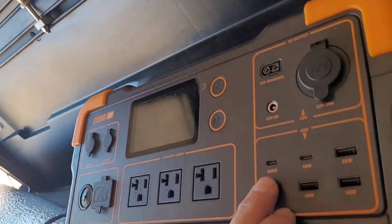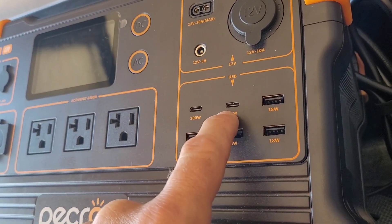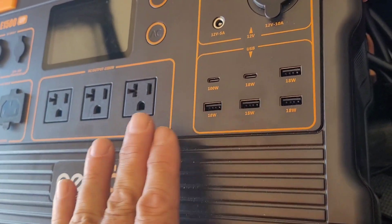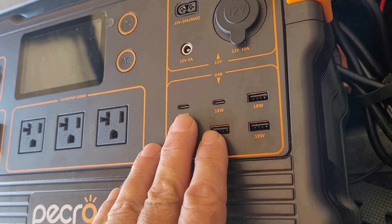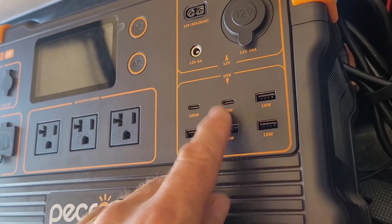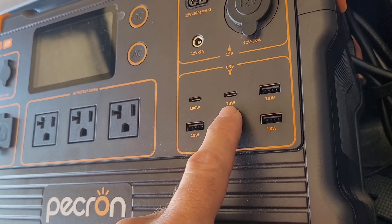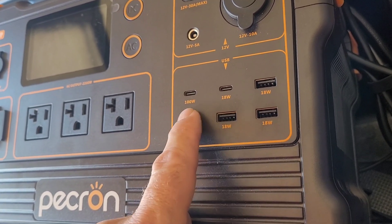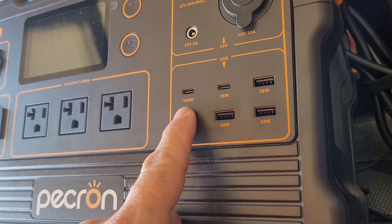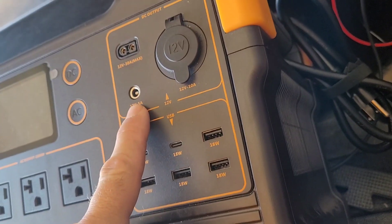These lights will take 75 watts total if you have the correct power supply. I think running any 12-volt thing off USB that starts at 5 volts is just a bad plan. They shouldn't be powering lights on a dimmer switch this way, because most people don't know about USB-C PD — they'll plug into the wrong port and have blinking lights, or the dimmer won't negotiate correctly with their power station's chip. This ought to be run off a regular 12-volt supply.